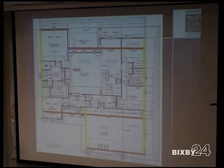I don't have enough bracing there to require it, because it's a continuous sheath method. It's based on the height of the opening and wall. You're going to need 30 inches, I believe. So to count this as a brace wall panel, you need 30 inches. So you only have 22, 24, 24, and 22. So you don't have enough to meet it there. So you know you're going to have to do one of your portal frames.